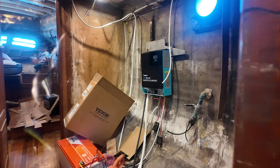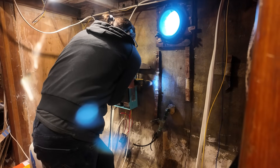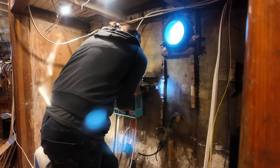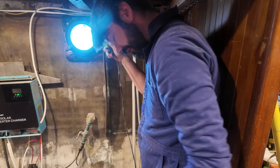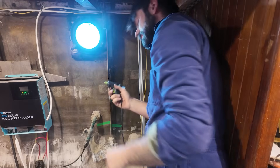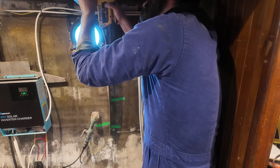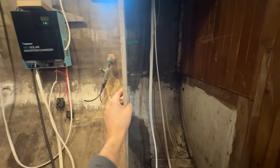Well, that sort of worked. We're going to just attribute the rest to a lack of stain and varnish, and get cracking on cleaning up this area, getting it ready for some bulkheads. We're going to do the patterning with door skin strips, staples, hot glue, and some cardboard, and then hopefully end up with something out of good strong marine plywood that actually fits. Alright, well, we've got a bulkhead. But it ain't straight — it's got a bit of a curve to it.